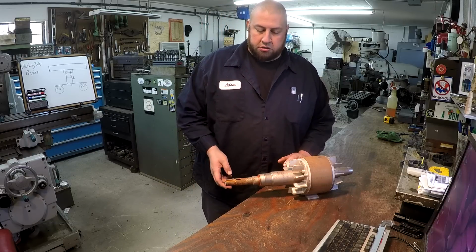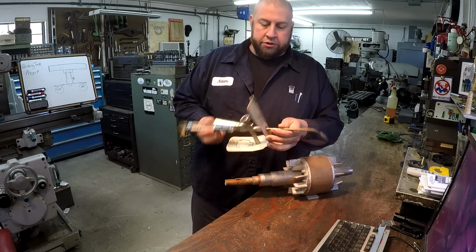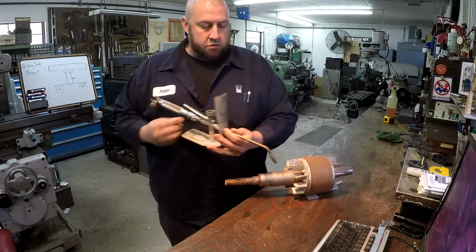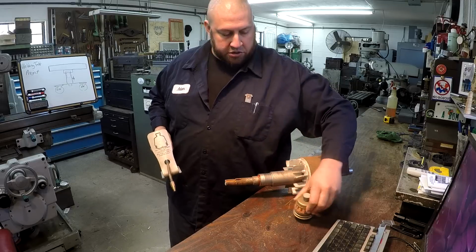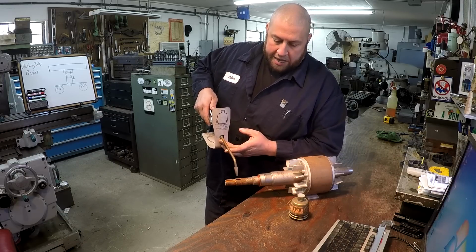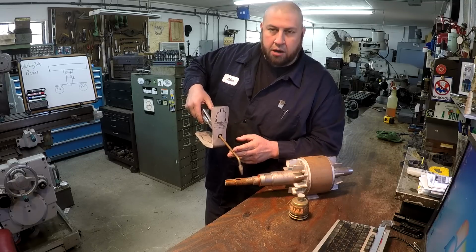And a Eutalloy torch is a little different than a spray welder, okay? I went ahead and got it right here so I can show you. That's my Eutalloy torch, okay? You can see it right there, Eutalloy. And this works a lot like brazing. Here's the powder. There's a little bottle of powder. When you're using a Eutalloy torch, it's like you're brazing. You're getting the part hot, and as you get it hot enough, you press the trigger here, and that allows the powder to come through, and it melts, and you're actually building up a lot like brazing.